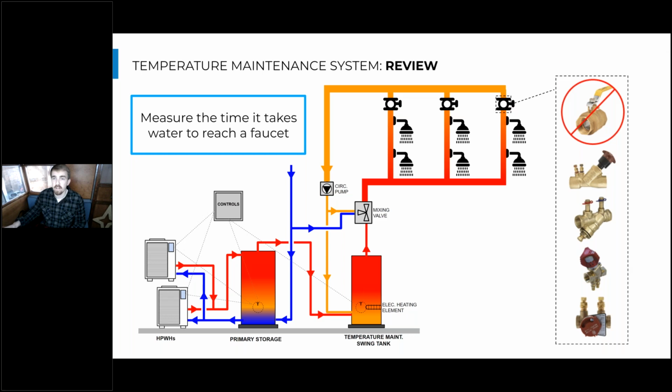So these balancing valves are really important and should be part of your maintenance schedule as you go through the system maintenance. Depending on the valve, there will be different considerations for maintenance. Sometimes they are thermostatic, so those components need to be cleaned sometimes. Sometimes they are constant flow, so they have different internal components, and sometimes, or a lot of times, they are this circuit setter type.